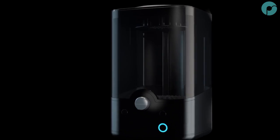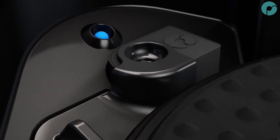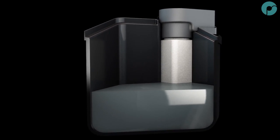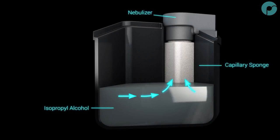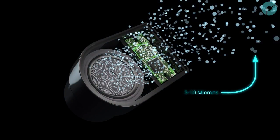The beating heart of the polisher's micro droplet polishing technology is the nebulizer. The nebulizer is a small piezoelectric actuator that converts liquid IPA stored in the polisher's reservoir into a fine particle mist by vibrating a thin membrane many thousand times a second.